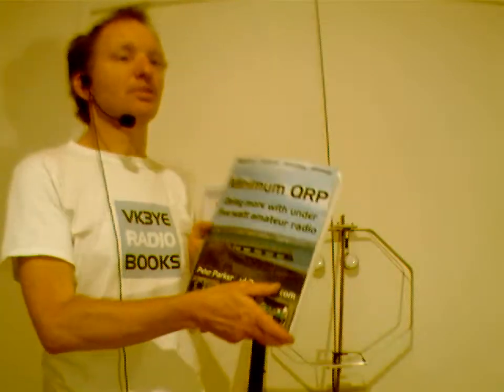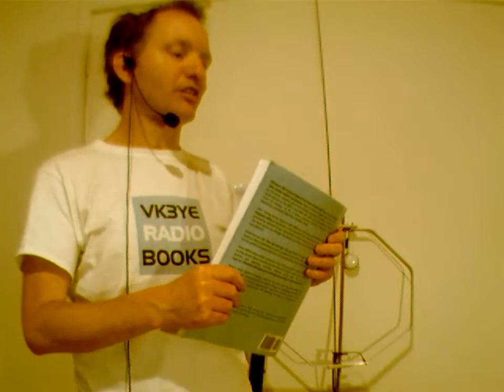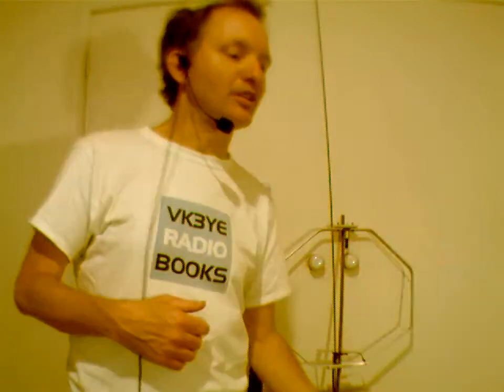The other option is that if there's no one about to finish or no one calling CQ, then you can start calling CQ yourself. Now, timing is really important. With QRP, you can't afford to be transmitting over the top of other people. On the other hand, you want people still to be around and listening to maximize your choice. In the minimum QRP book, I talk a lot about frequencies that are cold, where no one's listening, and frequencies that are warm, where people might still be listening. And again, you've got to pick a warm frequency to maximize your chance of being heard.